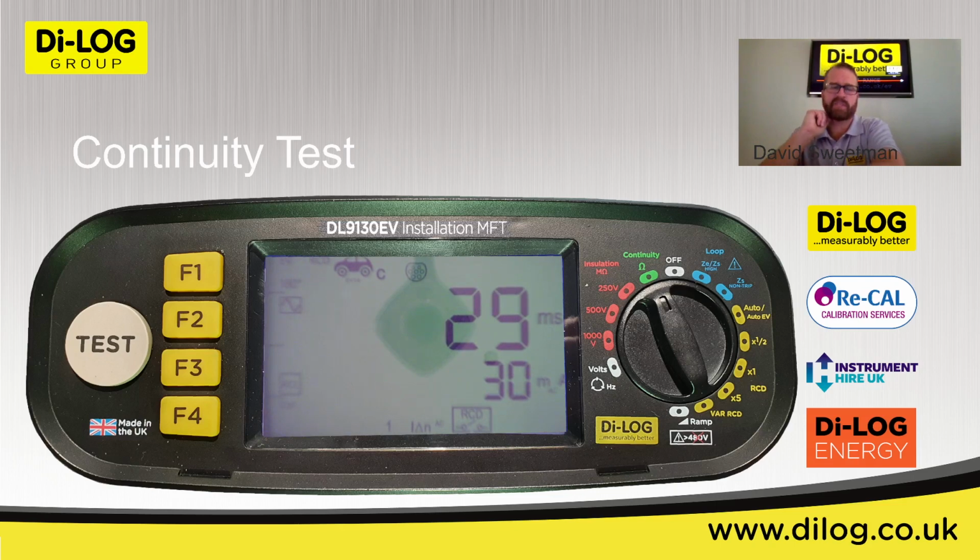So what you'll also notice is the screen goes from blue to green, so if we have put pass-fail parameters within this as well. If they do trip out of the parameters that are set internationally, it would indicate clearly. So for example, I've got a ramp test there at 21 milliamps, and as you can see for this exercise that I did with this, we delayed the tripping time slightly, and a 30 milliamp type A RCD on AC test tripped at 33 milliamps, which is over the permitted requirements. So you can see at any part of the test goes red and indicates a fail.